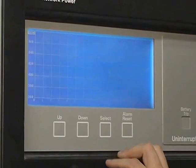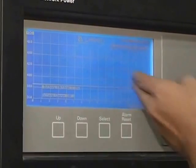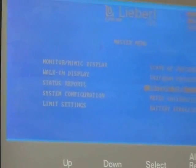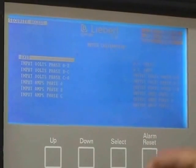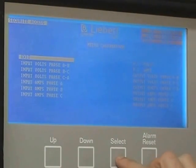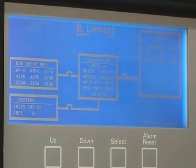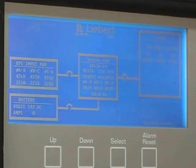Battery time — that'll tell us how much time you'll have until you've got a low voltage shutdown when you're on battery. Meter calibration just goes through calibrating volts and amps. Battery equalize — we don't ever worry about that anymore. What it does is give the battery a much higher charge to just kind of spike it.